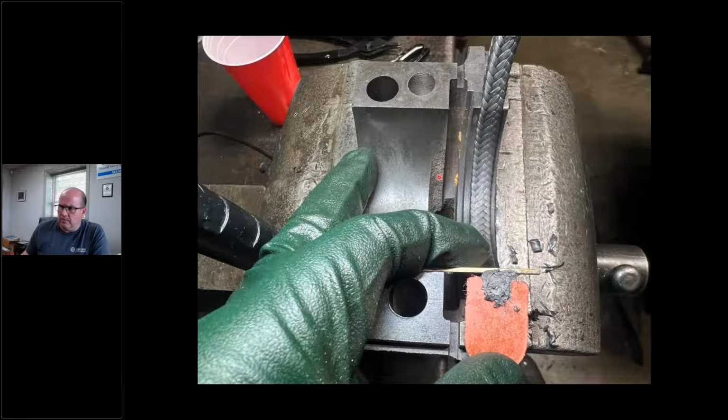So the first thing I do is I put this seal in the rear main bearing cap. And they've got this little thing here, looks like a broken nail file, and it just gives the right height. One of the things with rear seal rope is it's too easy to get it too tight. So if I can just trim that at the right height, that gives me a fighting chance that I don't have too much of this sticking up to really crush that seal and burn that.